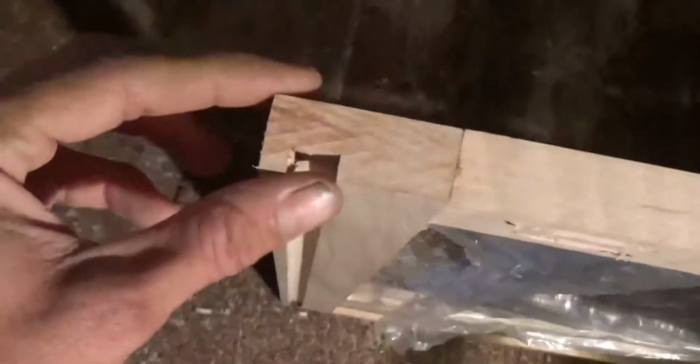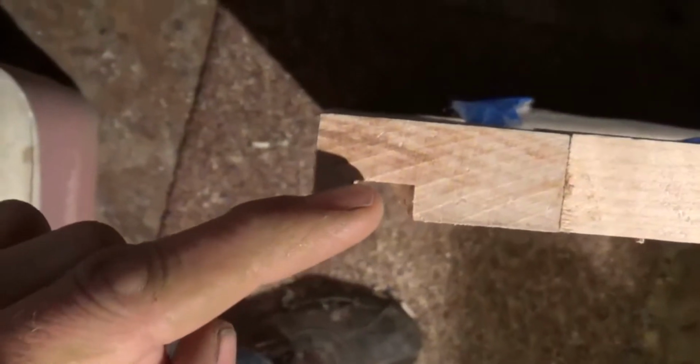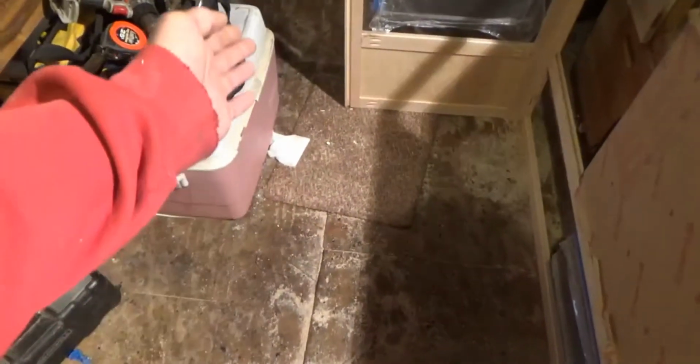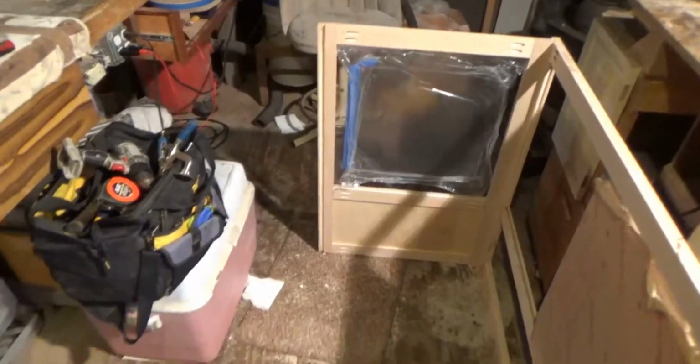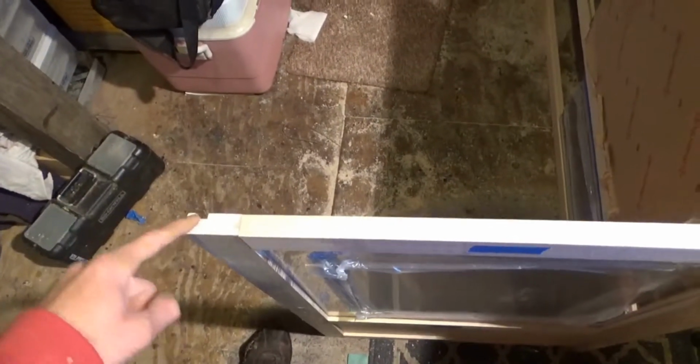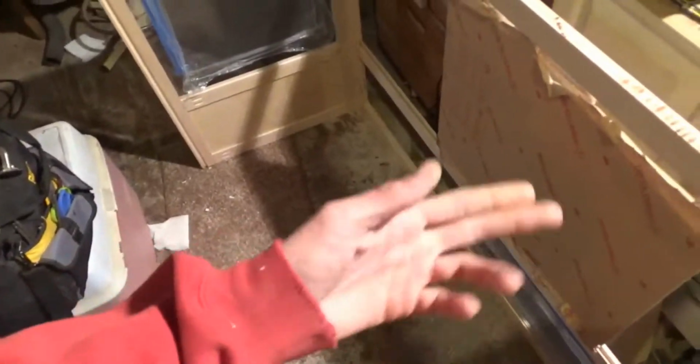And what I'll do then is just add the depth here. So it's probably about 1/4 inch. So 1/4 and 1/4, 1/2 inch. So whatever this distance plus 1/2 inch. And I know that the height is 36 inches. So 36 inches tall, and then say 48.5 inches wide. I'm going to cut that out of 1/2 inch furniture grade plywood, and then I'll have my back, front, and